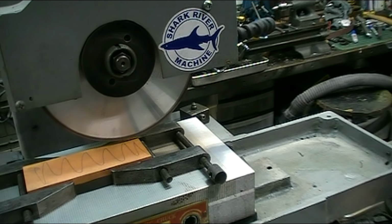Take note of how smooth the sound of these stones is when you face them together, as compared to an unground set. Big difference. And you can see that these aren't even hitting. They've got a hollow spot in the center. Add a check for flatness. These are pivoting at approximately a third off of each end.